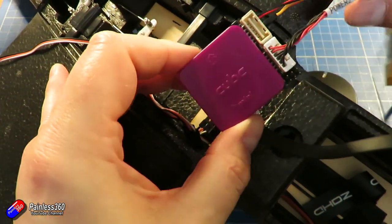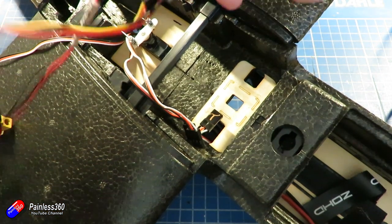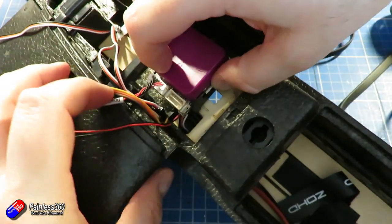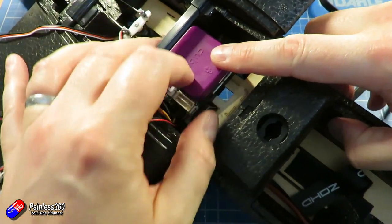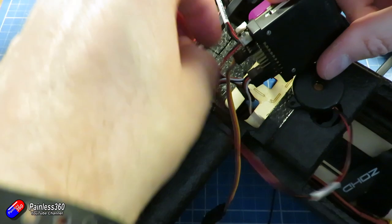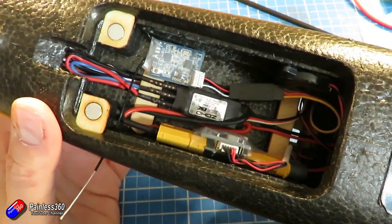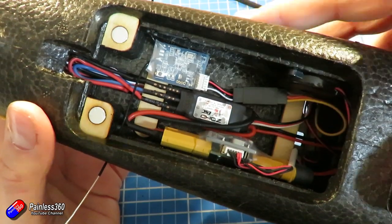I've had to plug in the purple cube and go through exactly the same configuration we did with the black cube — that only took three or four minutes. Now we're plugging in the power module, a buzzer so I can hear the confirmation tones, and all four main controls: throttle, aileron, V-tail left, and V-tail right. It is a little tight for space so I've had to work to make it all neat. With it together, the power module is tucked to the side, the ESC is nicely in the middle, and the buzzer and receiver are at the front.